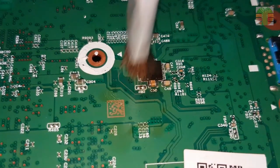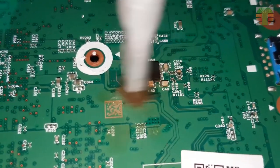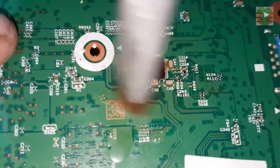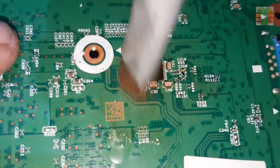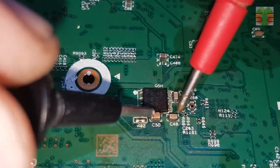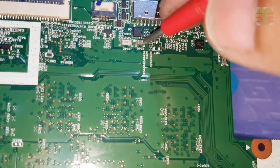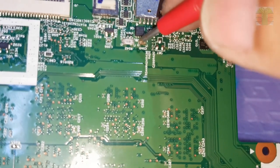It seems I succeeded in soldering the capacitor. Viewers are always asking me what the value of the capacitor is. You can put any capacitor of the same size and color, as there is no value printed on them. The size of the SMD capacitor and its color is the value. I'm not sure, but that is based on my experience. They are 2.2 microfarads to 47 microfarads.